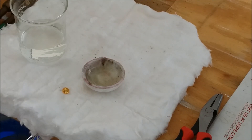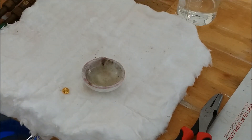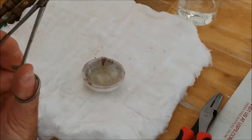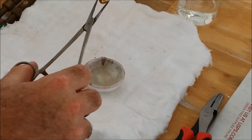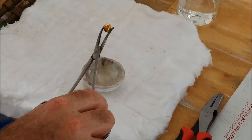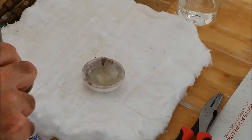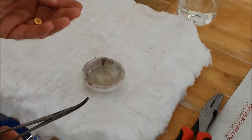What I'll do is take this water and put a few pipette squirts of sulfuric acid in it to make a weak sulfuric acid mixture, then boil it for a few minutes. That will take all the borax residue off — you can see some borax on the back of it. It'll make the gold really, really shiny. It's got a dark film on it and a lot of borax stuck on the bottom. That is a heavy bead — I'll weigh it after I clean it up and we'll see what we've got.